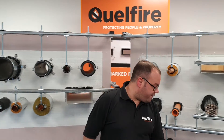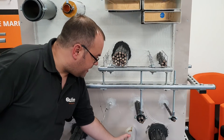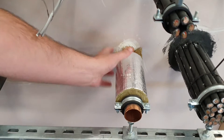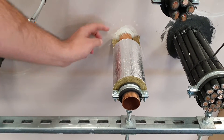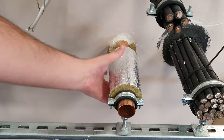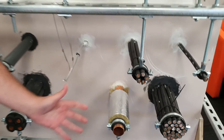Alternatively, what we have is what's called local interrupted insulation. This means the insulation is cut so it just starts and finishes at the face of the wall. We've cut out an example here to show you. The copper pipe is sealed using Quellstop acrylic sealant, and then the rock fibre insulation is butted up to the wall, typically about 300mm away.